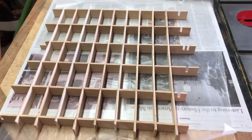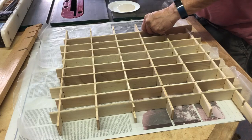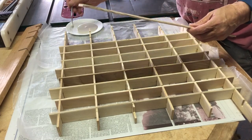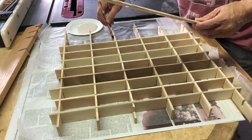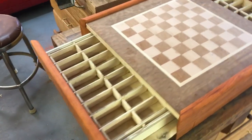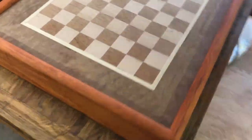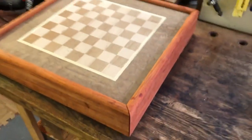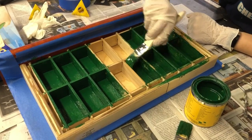Here's a dry fit of the pieces. There are five slots in here and I'm going to end up cutting that middle slot out. Once happy with the dry fit, I'm going back and starting the glue-up process with one of my solder flux brushes. From there I put a coat of shellac on and followed that up with four coats of lacquer, which I did not get on video. And here my daughter's helping me put the paint on for the flocking.